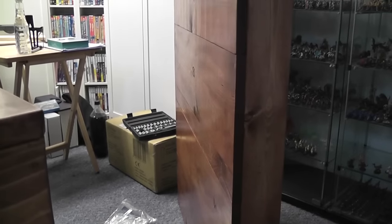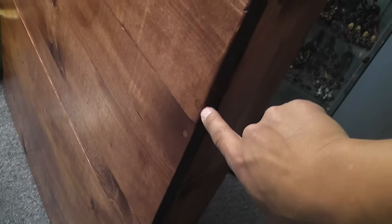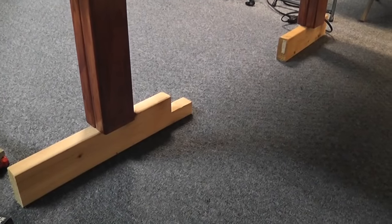The way I messed up is I intentionally left one board unscrewed, but then I covered up the screw head with wood putty and didn't want to ruin the board by drilling back in. So I ended up screwing the top piece on permanently and had to go in underneath to attach the shelf — much harder to do by feel rather than by sight. So make sure if you're putting in a bottom shelf to not screw in those two end boards so you have easy access.